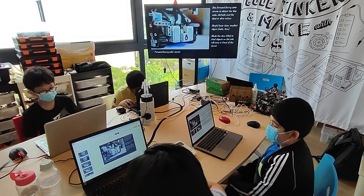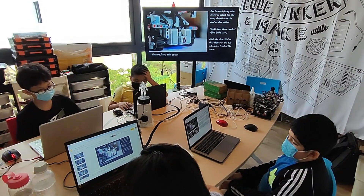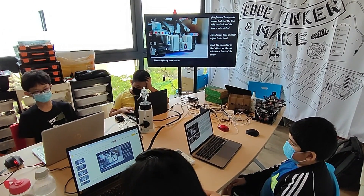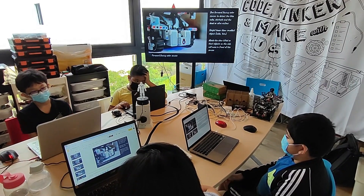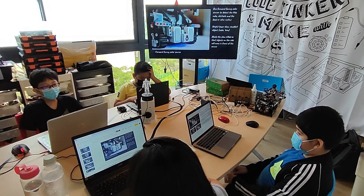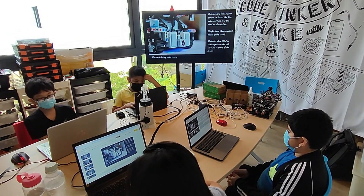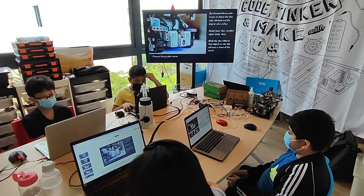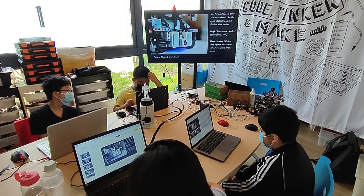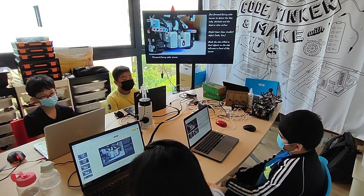We will now be talking about the forward-facing color sensor. As you can see from the picture above, there is a forward-facing color sensor to detect the rescue kit and obstacle on the line, and the dead or alive victims in the evacuation zone. One consideration was to make sure that the height of the color sensor was smaller than the smallest object, which is the 3cm cube. Also, since the sensor can only detect directly in front of it, and the cube and balls may be off to the side, we made sure that the claw was slanted so that items to be collected will move in front of the sensor as the robot drives forward.